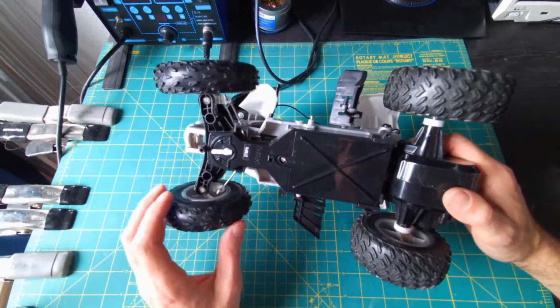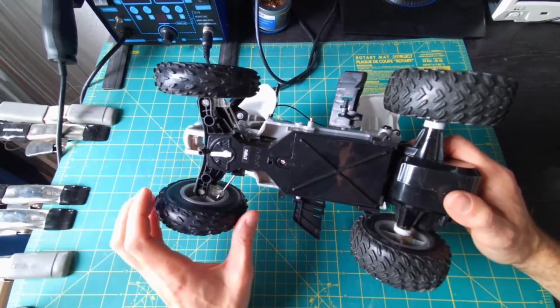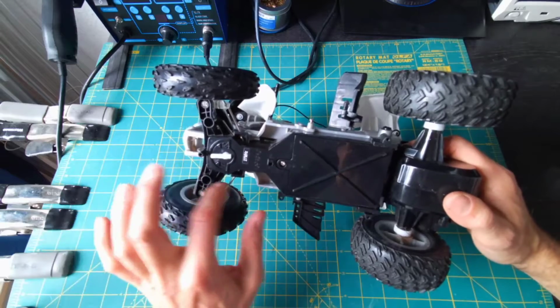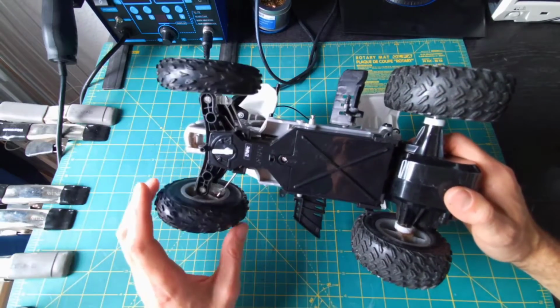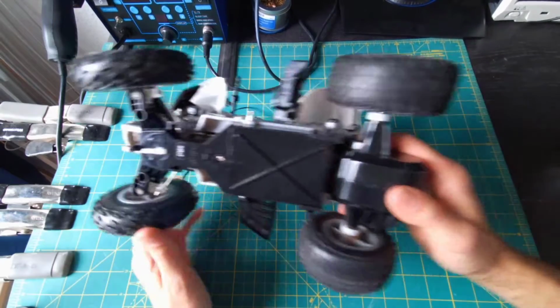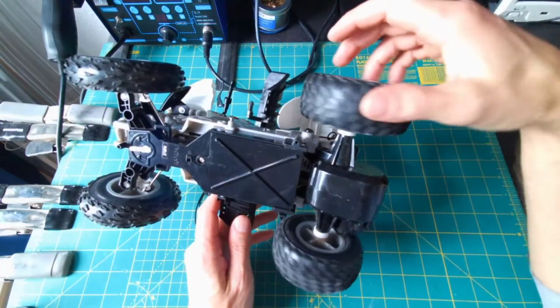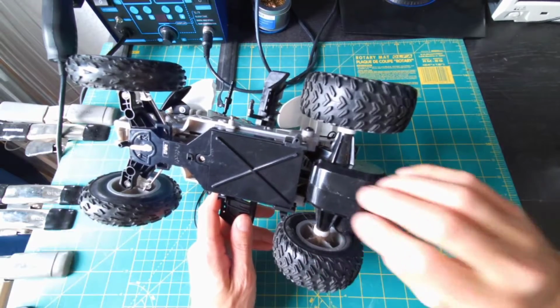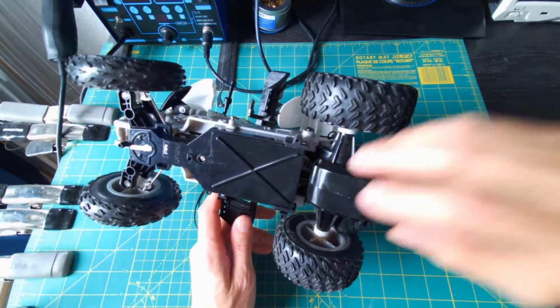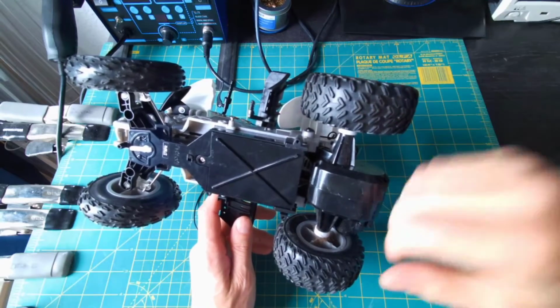That's going to be really helpful if it returns to center when the motor isn't powered. And that nothing's broken on it. There's a lot of little pieces here that can sometimes be abused, including this tracking piece that can fall out sometimes. On the back, it's always worthwhile to spin both the motors. Make sure you can feel a little resistance and hear that there's some gears back there. This one seems to check out.